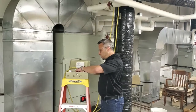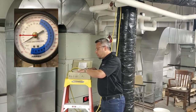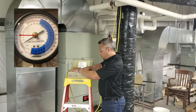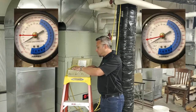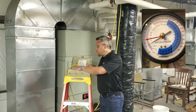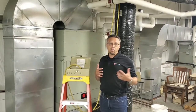Opening the high side valve, it indicates 24 pounds — but more importantly, 56 feet of head loss. Now I am going to close that and open up the low side. The low side is indicating 38 feet of head loss. So that is a differential of 18 feet of head loss. Now we are going to take that and use the Bell and Gossett balance valve readout calculator.